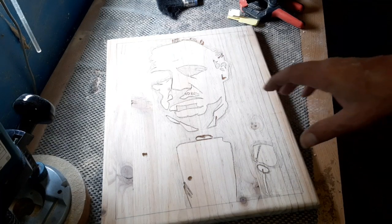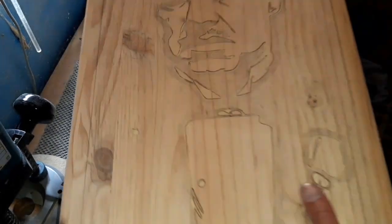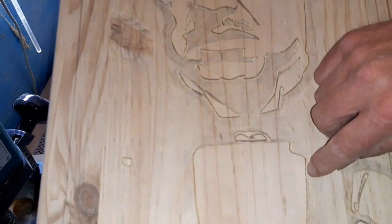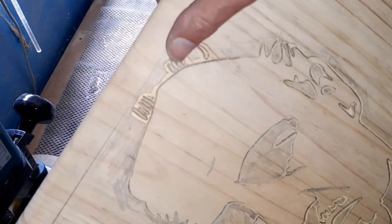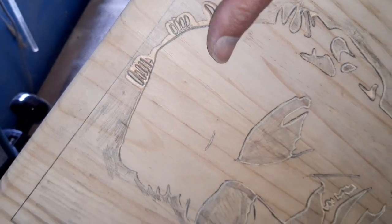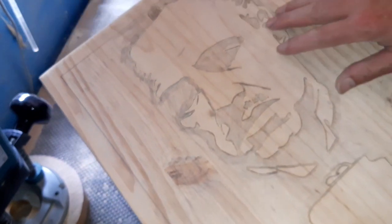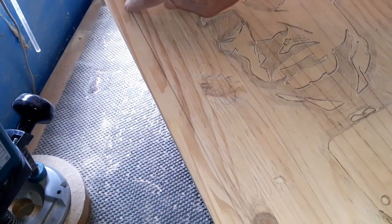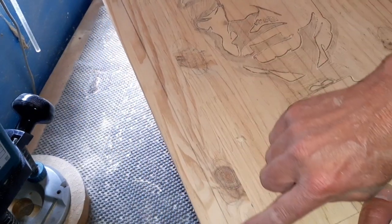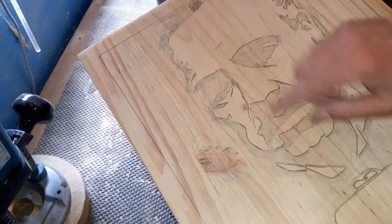Hopefully you can see from that we've gone all the way around the lines with our CNC bit, and towards the airline at the top we just nibbled those away. Now before we start removing the background, we just want to route out the framework whilst we have the CNC bit in and set at the same depth.